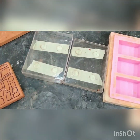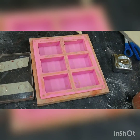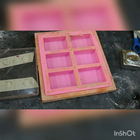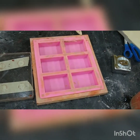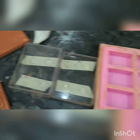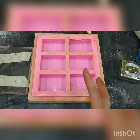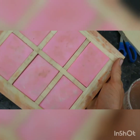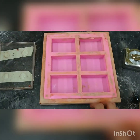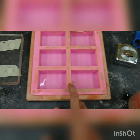These are our molds. I'm doing two sizes — these are the big ones, these are the small ones. I can't recommend these things enough. These are silicone soap molds — I got them on Amazon. This top one's kind of broke, I don't use that one anymore. But there's like $10 for three of these things, which means you can make 18 blocks at a time and really crank out some nests. For the silicone, you don't need any kind of mold release spray. But since it's not rigid, when you pour your material in it will expand. So I made this little wooden frame thing so they can expand and stay nice and square.